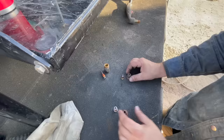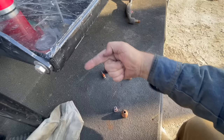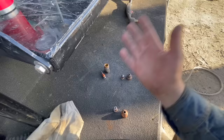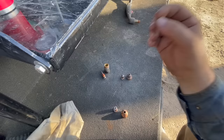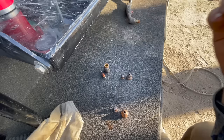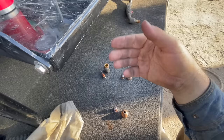So what's the real difference between cutting and gouging? Well, cutting is more of a line. Imagine like taking a hot knife and moving it through, you know, the distance of the arc, which is an inch to 2.5 inches or whatever, depending on how many amps it's set on. And that hot knife will just cut right wherever you want to cut. The cutting arc is smaller, and the cutting arc will lose the arc easier than gouging. So gouging is a little bit like a fatter arc. It doesn't dig into the material as much, if that makes sense. And it doesn't have as deep of a cut. So you could cut something thinner on gouging, but not something thicker, because it would just kind of build up, if that makes any sense.